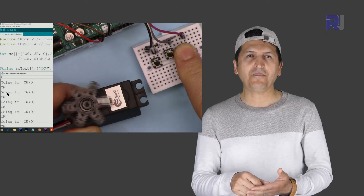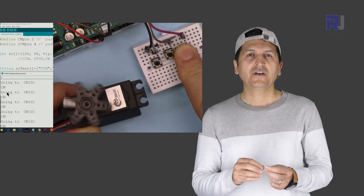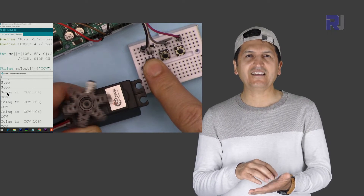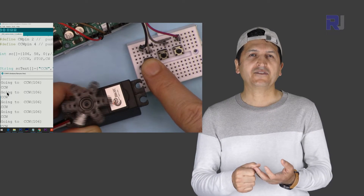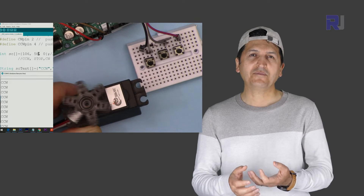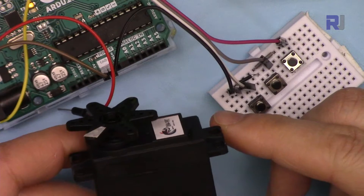You will also notice that when you press the stop button, the motor will stop but slowly, and you will hear some clicks. The reason for that is the quality of the circuit in the device — resistors may have 5% or 10% tolerance. You might find a servo motor that fully stops, but keep in mind that in this example the servo motor will start moving a little.